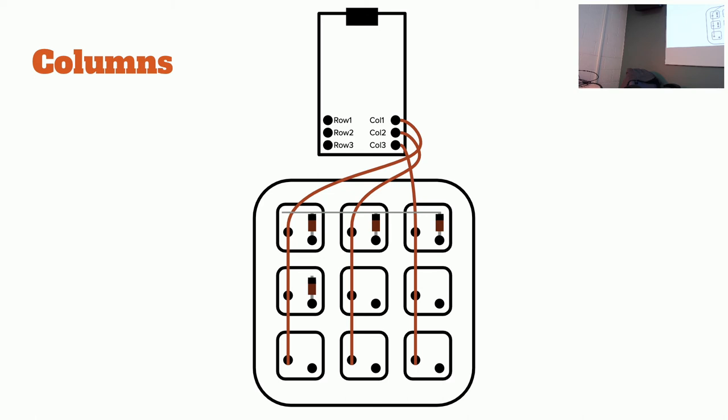Okay, patch it, right? So take this, do that hook connection, and solder up a connection there, and then maybe later you can take heat shrink or just electrical tape. Should be just fine. Let's see if we have some electrical tape in here.